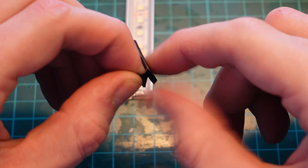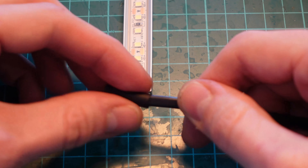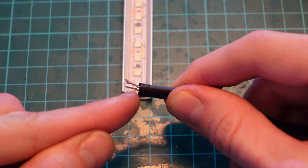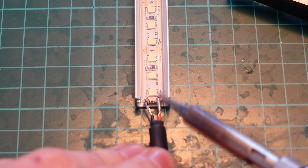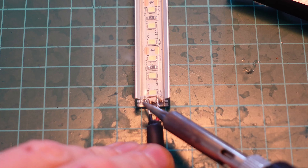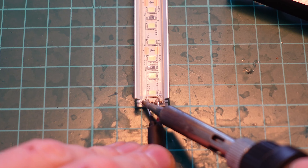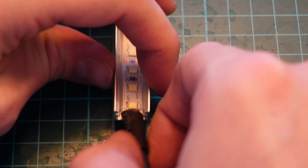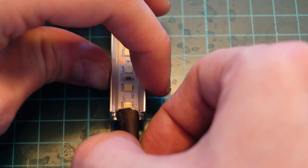To prevent the contacts touching the bare metal, I'm wrapping the wire in some heat shrink, with a slot cut in the side, so I can slide it over the strip. As we've pre-tinned everything, we can just press the wire and contact together with our soldering iron. Make sure you solder the red to the plus rail and the black to the ground rail — this should be indicated on your strip. Then slide the heat shrink over the strip and use a heat gun or a hairdryer to set it in place. If you're using an LED strip to wire connector, you won't need to do any of this.